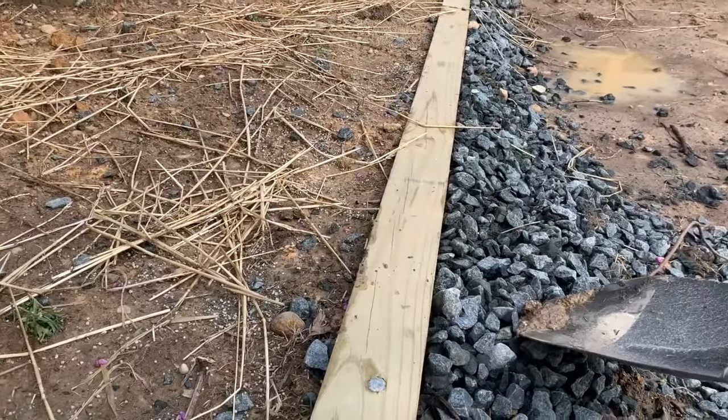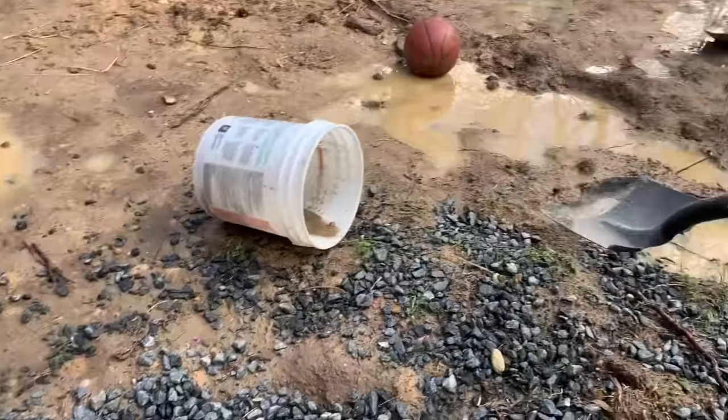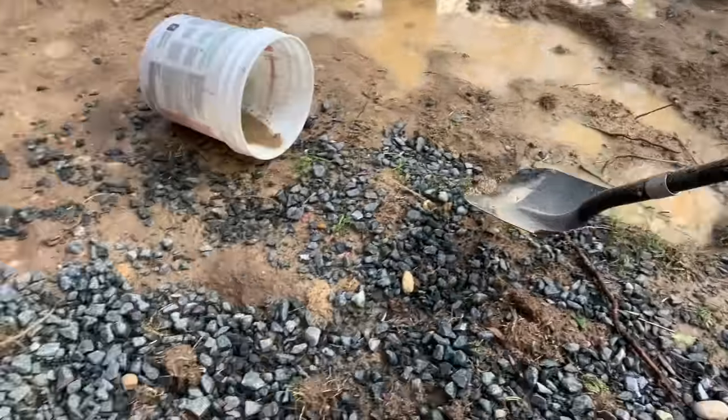And then in the box itself, the dirt, I measured out another 8 feet, and that drops another 4 inches. So then across the 12 feet here, I've got a total of 6 inches, probably a lot more actually, because there's a huge step here. So nice drainage away from the house. Got some puddling here, which I might make a little bit of a swale to drain it out to the rest of the slope part of the yard.